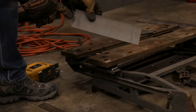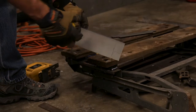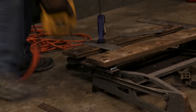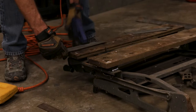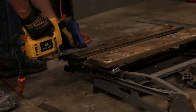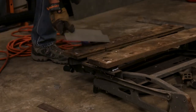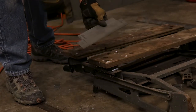After cutting the 10 by 3 inch rectangles, I'll then cut 1 inch squares out of the two corners. This will allow me to bend 1 inch tabs on the bottom and the sides. Alright, now I'll go clamp this into a table vise and then bend some 90 degree tabs. Let's go bend some metal on a vise.